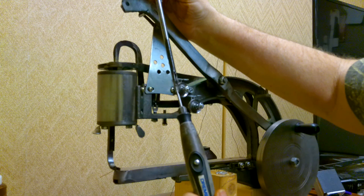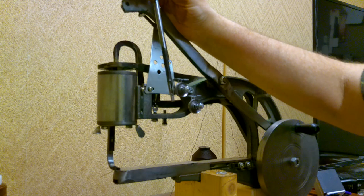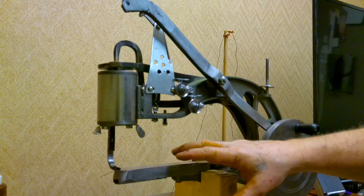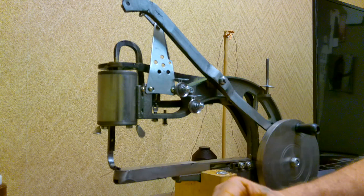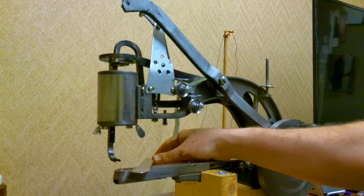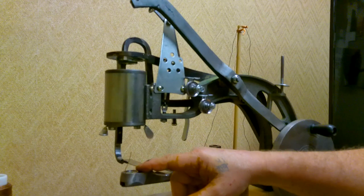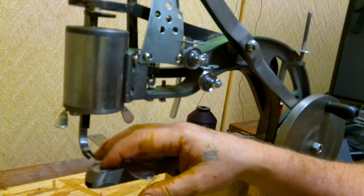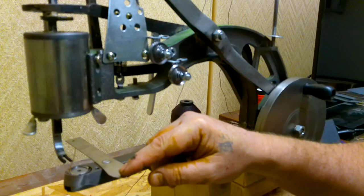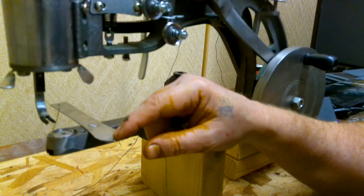That's part of the modification. The other part — I'm just going to describe it because I had to take my sewing machine off its mount and flip it upside down. You've got a couple of things you need to do on this arm right here. You know you have this bobbin cover — with the larger size needle you're going to need to enlarge a couple of holes. The first hole you need to enlarge is right here in the bobbin cover, so the needle is not going to bang against the edge.